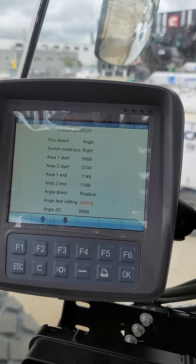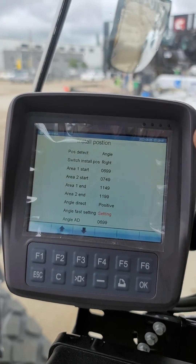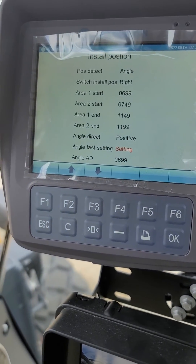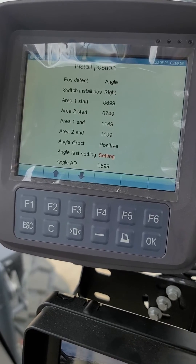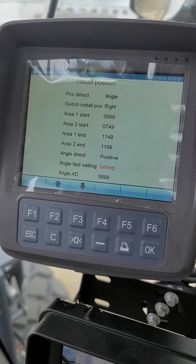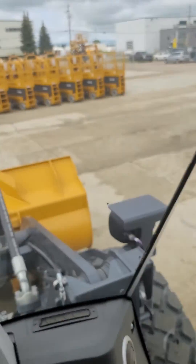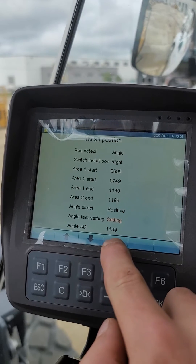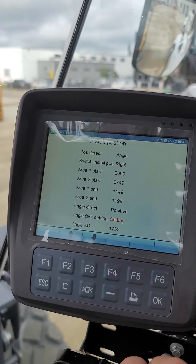From the factory they only weigh really high up, so this is the way to solve that. About 700 — some guys like it at about 750, I go with 700 just to be safe. Then you'll notice if you boom up for auto lift, as soon as it hits that 199 it beeps — that's when you know your scale is set and it's weighed.